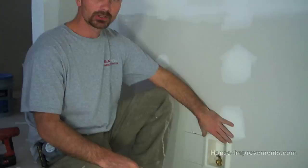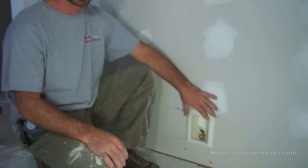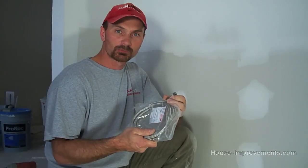If you happen to be doing a new home, you may want to go to this type of system here, which is actually installed by the plumber. It's all completely in the wall and hooked up to your supply line already. All that's needed after that is this braided flexible line. It simply hooks to the valve on the back of the refrigerator just like the other one, and you're set to go. So again, this is just more for new home installations.